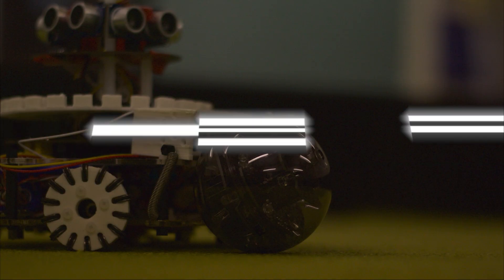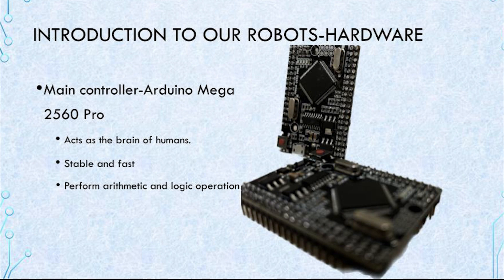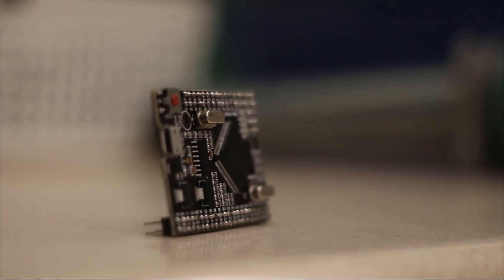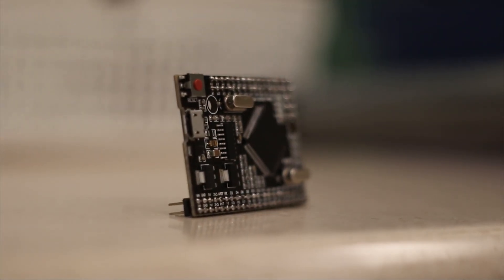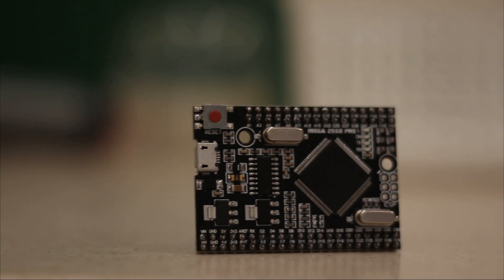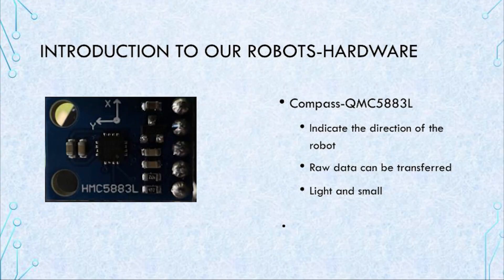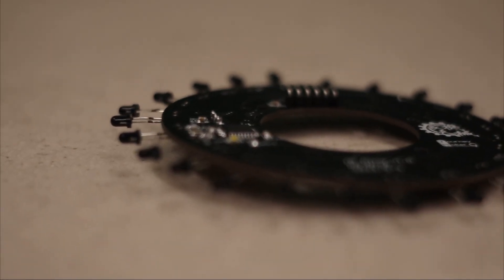Here is the introduction to our robot. Arduino Mega 2560 Pro is the main controller of the robot, which acts as the brain of a human. It is stable and fast in data processing speed, speedily executing the instructions of our program to perform specific tasks more efficiently. It is inserted on our main board and connected to different components. As the team's description paper mentioned, we designed our own PCBs: a main board, an IR sensor ring, and an ultrasonic sensor ring.